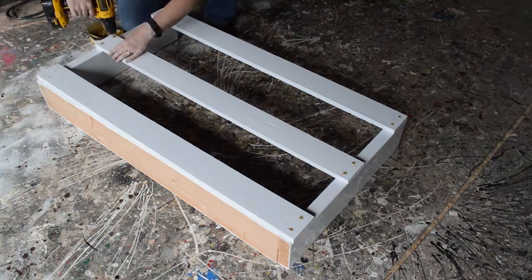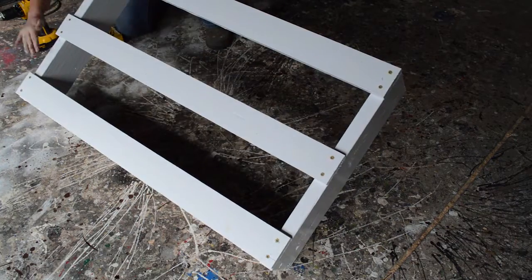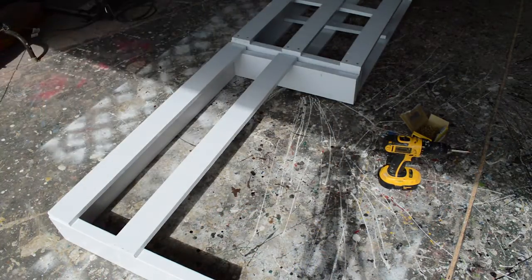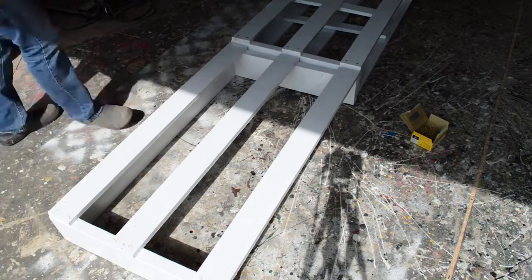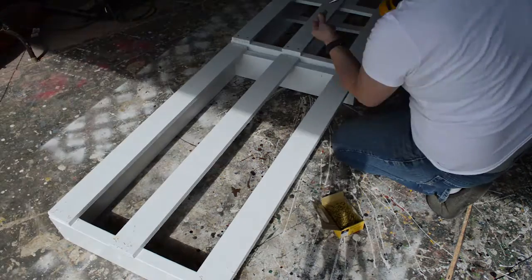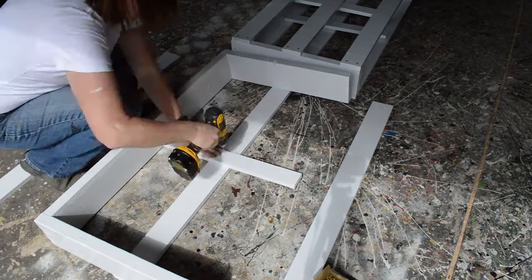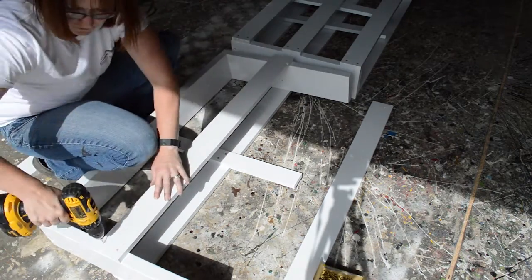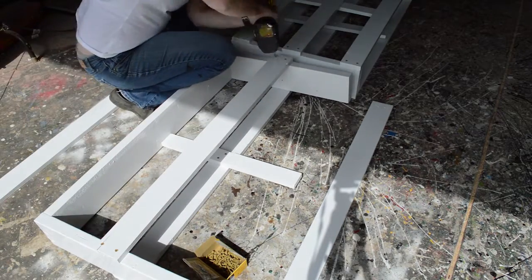You're going to do that on both sides of the brush box, but before you do that it's important to put the little inner furring strip in because it's a lot easier when there's only one side of the one by fours in place. I have the brush boxes laying next to each other to make sure that the one by fours are going to be equal and in the same spot — because that would look silly if they didn't match up — so I'm making sure they're uniform in appearance. And I'm attaching the furring strip, which is easier to do when you don't have all of the one by fours in place.